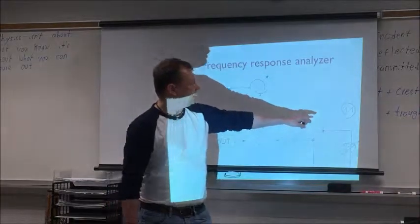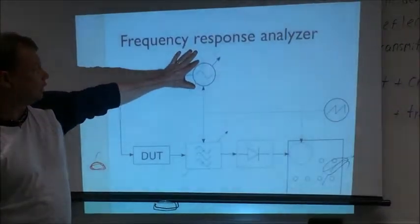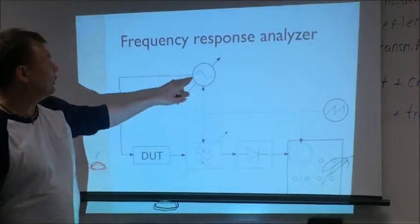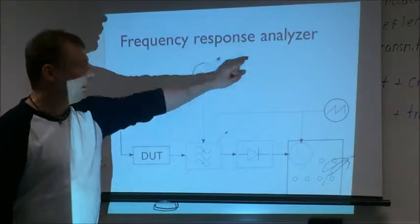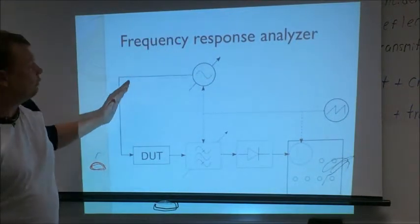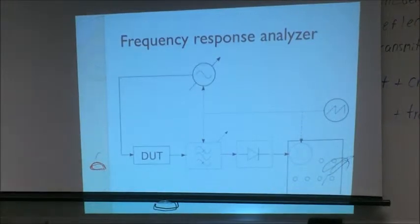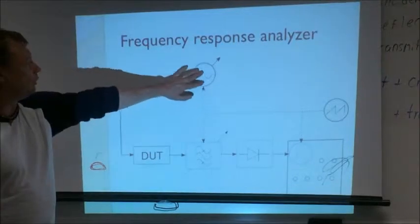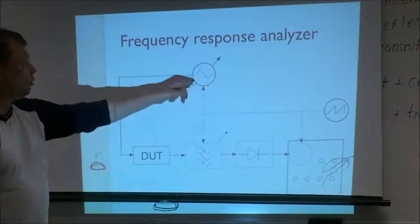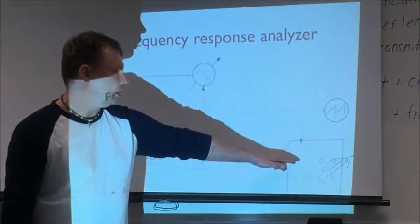The band-pass filter must be matched and tuned with the generator because you want to cut everything from the input except your signal coming from the generator. Then the amplitude detector feeds the graphing device. The sweep generator controls the horizontal axis, and the signal from the amplitude detector controls the vertical axis — so the higher the signal, the higher the beam goes. We go from low frequency, very little signal, then reach our band pass with high signal, then again low level.